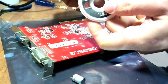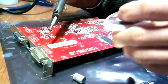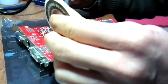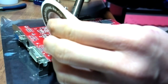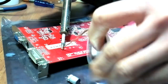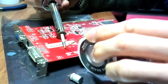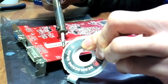Then use some kind of soldering wick like this one to suck up the old solder. Once you can suck up the old solder, you can have enough space to insert a new capacitor. Just be careful — make sure you have enough flux to suck up the old solder, and don't yank it if you get stuck. Just heat it and let it come off by itself. If you yank it, there is a possibility you might detach something nearby or on the connector itself.